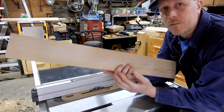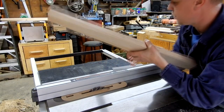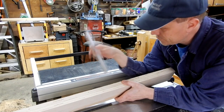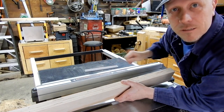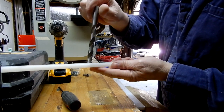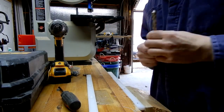The sled is going to have the miter. Once you get this all glued up - this is the back end - I'm going to cut a dado slot for T-track so I can add whatever I want in the future: three-quarter wide and 400 thou deep, so a little more than three-eighths. I guessed this is a three-eighths drill bit and luckily it fits right into the countersink. I'm going to drill these four out, countersink them, and then the runners will be ready to accept the plywood.